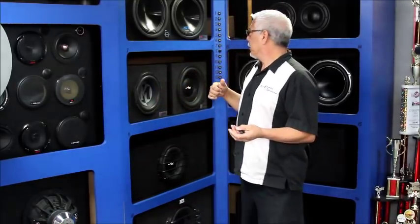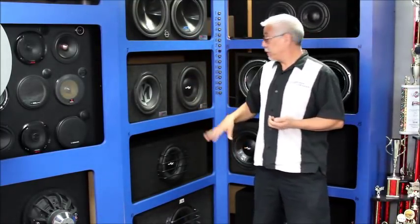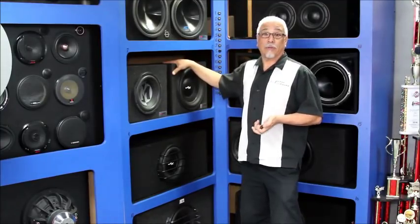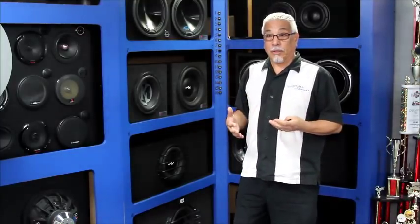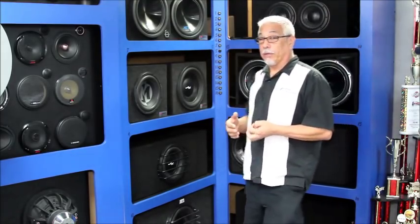When I first turn on the sealed enclosure I'm going to go to about 25 on the volume, and you're going to notice that the speaker — you may not be able to hear it through this video — but at that point in this type of enclosure, the speaker starts to make mechanical noise because it's reaching its mechanical limit. It's not the speaker's fault, it's not the amplifier's fault. It's just that any speaker in this environment is going to experience mechanical failure or stretching of the mechanical limit of the driver. It's just the nature of a sealed enclosure — it's not very good at helping the speaker create output and create bass.